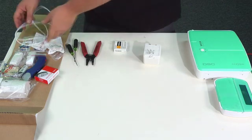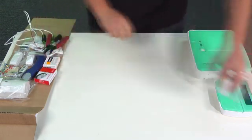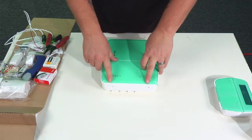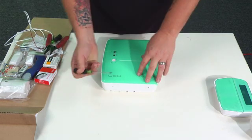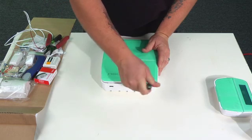What we need to do is open up this panel. If you're looking at the panel on the bottom, it'll say DSC and Alexor, and there are two tabs at the very bottom. Find yourself a flat blade screwdriver and you're going to insert and pry on both sides.